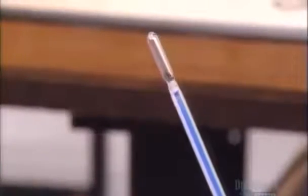To test a sample of the production run, they heat the entire length of the tubing. This creates vacuum pressure so that when they place the open end in liquid wax, the tubing sips it up like a straw. By watching the liquid ascend, they confirm that the thermometer fills as it should and has the right dimensions.